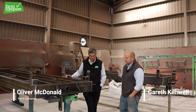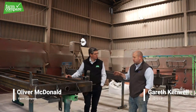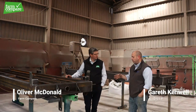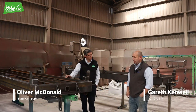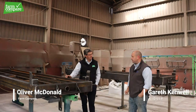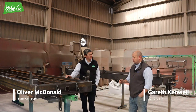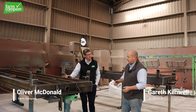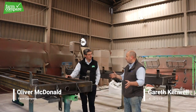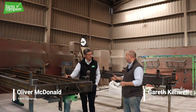This is our 10-ton trailer and because we started with it, the amount of units we have out is certainly exceeding the 90 mark at this minute in time. It's definitely punching well above its weight. We did make a change just over a year ago and we converted it to the square chassis as opposed to the taper chassis. That allows us to utilize the sprung drawbar and different bits and pieces — so a better offering and a stronger, more stable trailer.